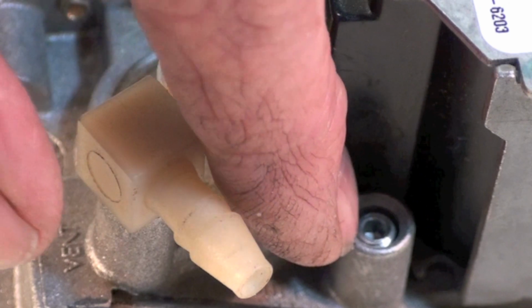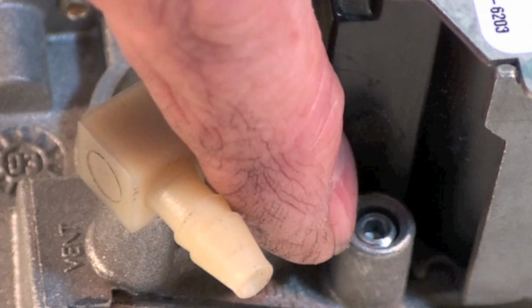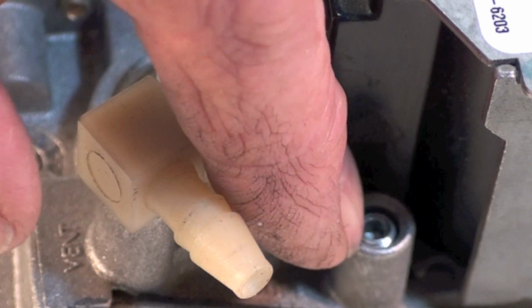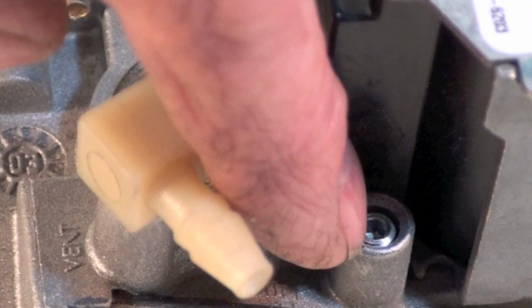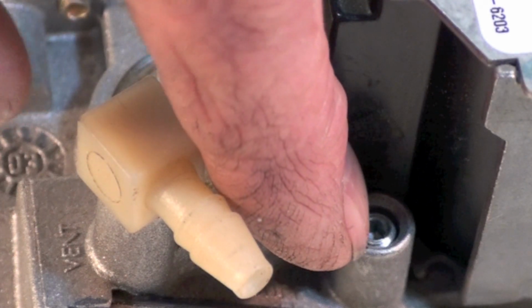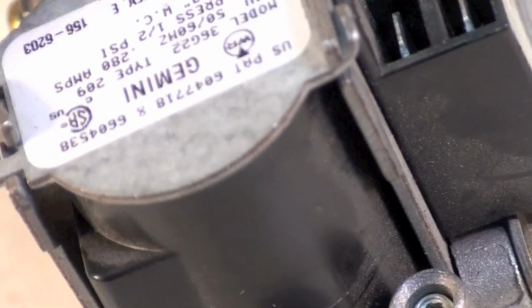So you're going to need like surgical hose, which is the best stuff to use. Put that, turn this thing loose. Do not take it out. Turn it loose a turn or two, and then put your hose over it, and you can read manifold pressure when the machine's operating. Now it's got the same thing here,